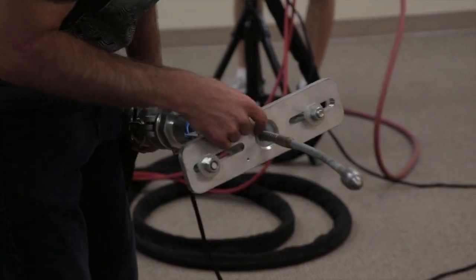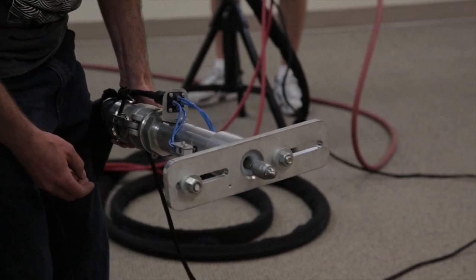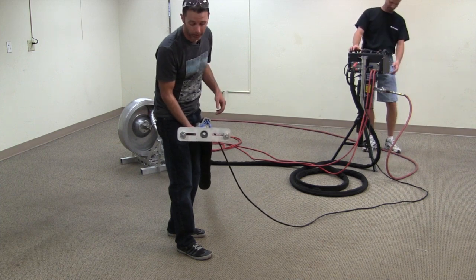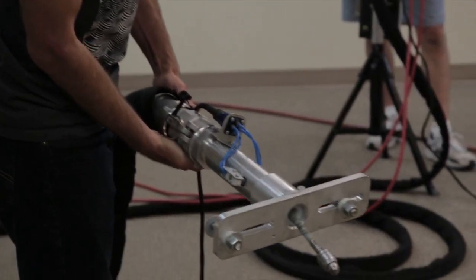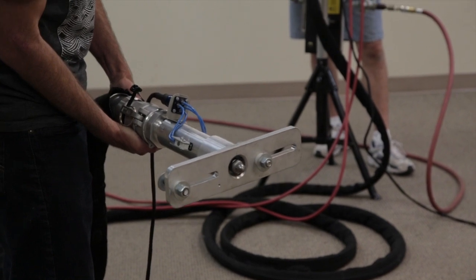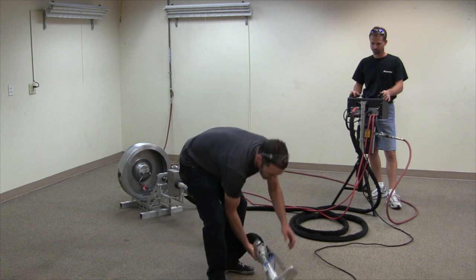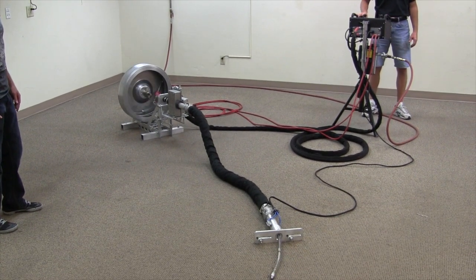Whenever the tool backs up here, it's going to push in on this plastic shuttle inside there and activate these switches. It's taking up slack right now — inside the snout there's some slack, so that delay is just it pulling in all the slack from the snout. It pulled that shuttle in and activated the switches. Now you can try to hit forward — that's the only operation that works now. Go ahead and retract all the way and show them how you can hit rotate or reverse and nothing happens. A little safety feature there.